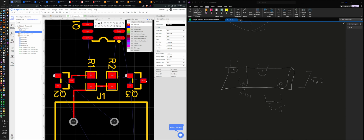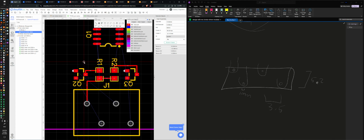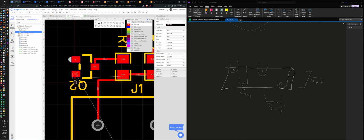So we're going to do something called a via. Now I'm going to grab the via from my other project. So that is a via. Right, and I want to remove its association. There we go. It will not let me move this via. There we go. Can I move the via? Put the via right there. Okay, they are touching. Routing conflict, ignore.